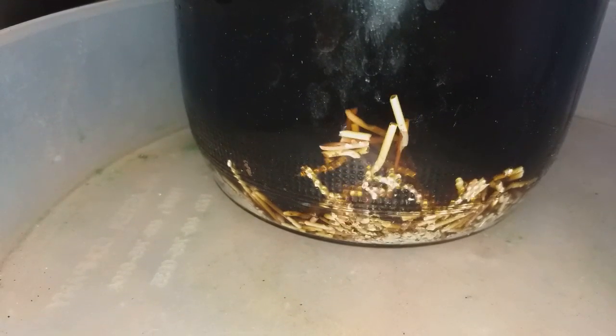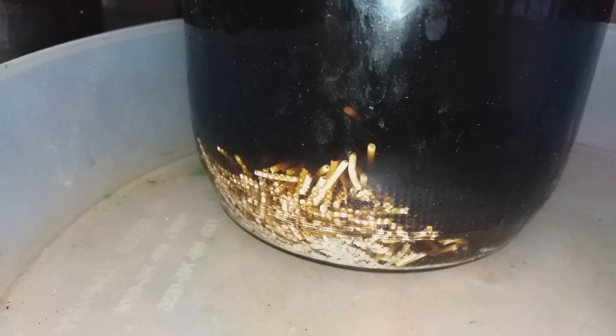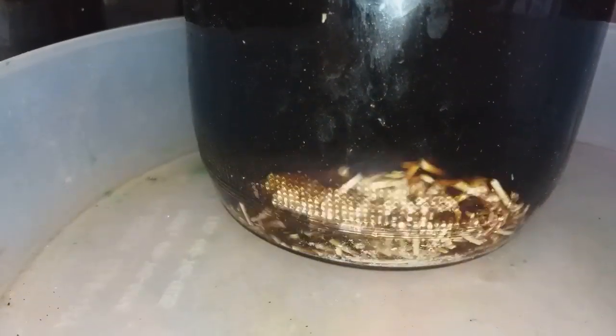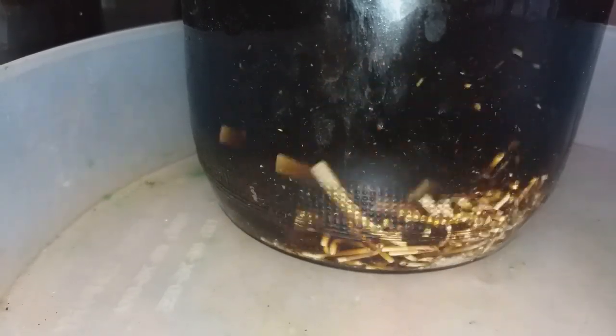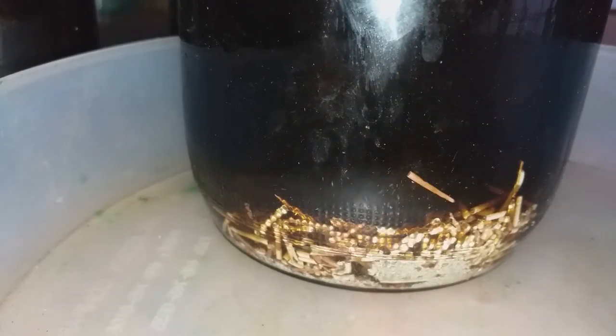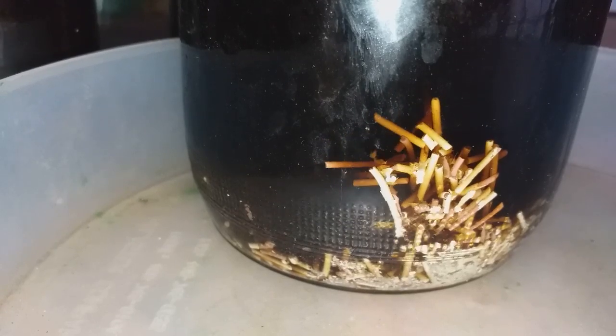You've got some exposed copper — see that. They need a lot of time. It's much easier with gold-plated pins, but in this case silver is very hard. Silver-plated pins are very hard to dissolve. We've got all these little particles when I stir — it's actually silver and it's very heavy, not like foil. Very similar to cementing silver from nitric acid. See all that exposed copper and little white silver foils on it.